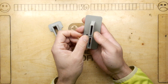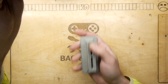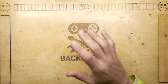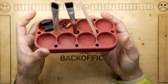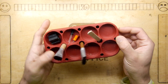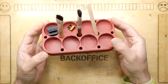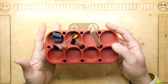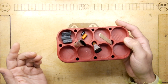One thing I showed you before was the component lead bender, where you put in your diodes on the tape - these have been pre-bent - and you go bang and you've got seven bent at once, which is super useful when putting together loads of through-hole components. From the modeling video, that's the tray I'm using in anger and it is actually useful. I think I've got it up on Thingiverse - I'll put a link below. I've used it with surface mount components and it's pretty bloody handy, so definitely print one of those.